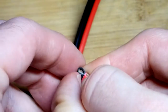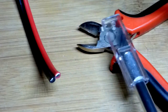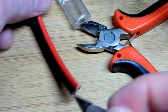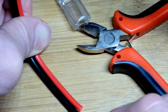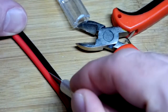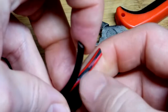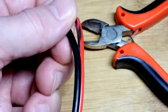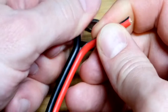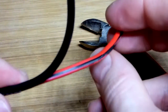One common complaint in the reviews is that the red and black cables don't peel apart very well — the red sticks to the black and I don't think I can just pry it apart with my fingers. I grabbed the blade from the same basic electronics tool kit as those wire strippers and I'm going to try to separate them that way. Just scribing down both sides — and now let's see if they come apart. They are coming apart. I got some black there but no exposed wire, so so far that's pretty good. I'll probably just scribe whatever length I need, and it looks like we're doing well peeling it away as long as we scribed it first.